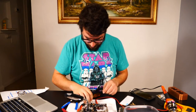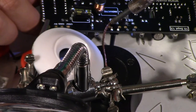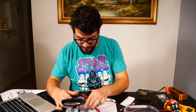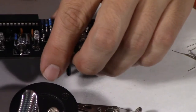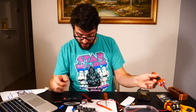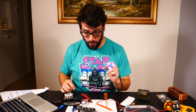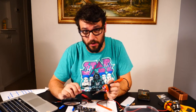It's going to be even more painful getting them back in. Take two — hopefully the final take. We're working with botched buttons now, but we're back on track. We've got the buttons set going out the back. Finally — we're going to finish this thing. Important note: if you get the copper or aluminum case, the buttons go on the backside of the main PCB board, not the front side where it looks like they're supposed to go.